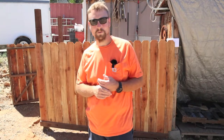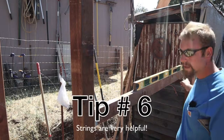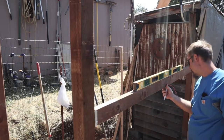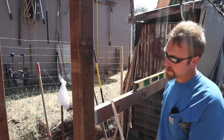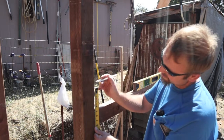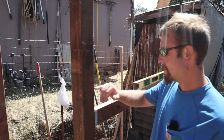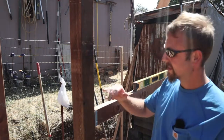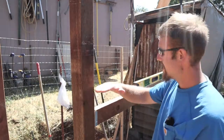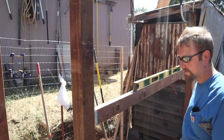Strings are really useful in the construction industry. So I took the measurement off the piece I've already mounted over there. If this is level — which it is — I should be able to take that measurement and bring it over here and transfer it to this post. That mark and the top of that fence are level. I'll take a string and run it off the top of that over to here, and that'll give me my level height to cut my fence boards.